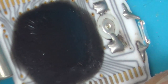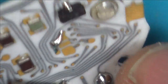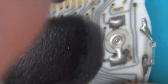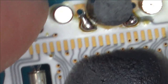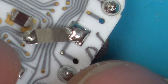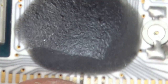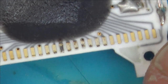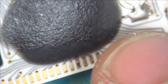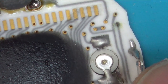There's a little backlight on this — you press the button and it lights up so you can see the screen. Not sure what this thing is here. Some sort of coil up there. These two metal things go off from this side on the tracks, which look like they're painted on. There must be some sort of chip underneath this blob here. If the chip's gone, this won't be fixable. I think I need to get a bit of IPA, but I'm worried about scraping away this conductive paint. It looks like the battery may have leaked at some time. That little wire's gone.